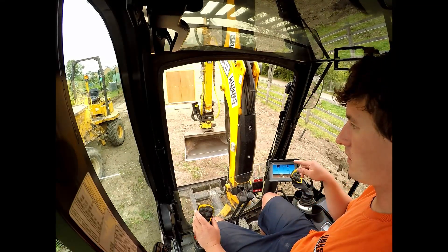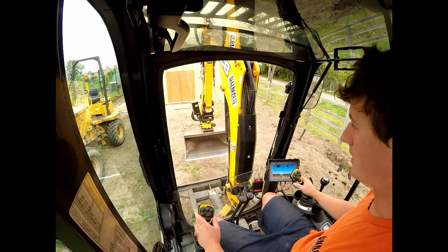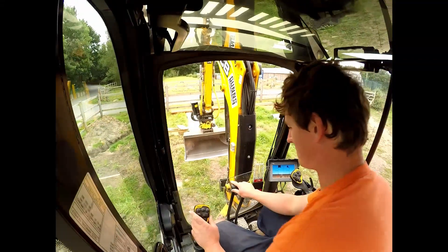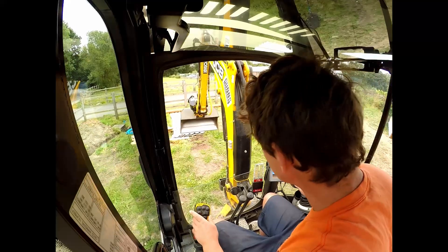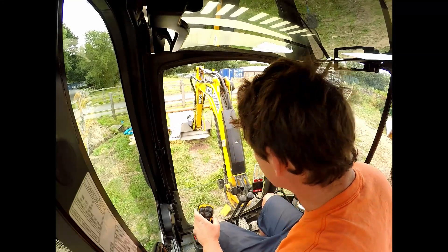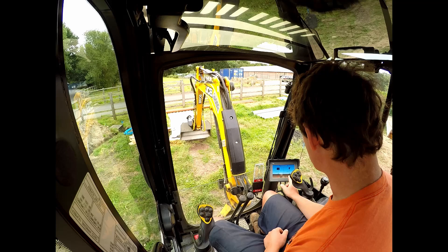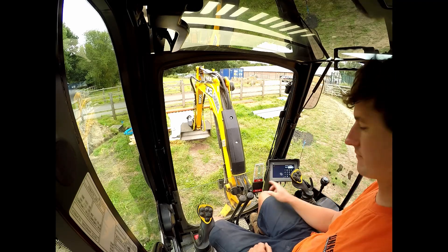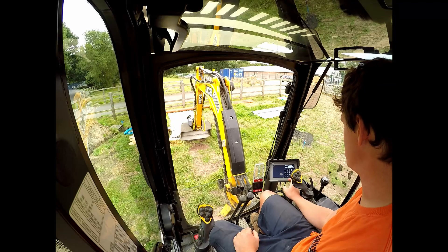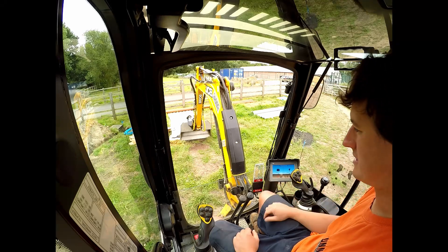Knowing I'm 200 mil higher, it'll work it all out. I can turn around to the high point because that's where I want to dig down from. I'm not removing the pin because I've got to put pads where those pins are — I'll leave them in as they're set out accurately. So I zero it — point two is what I'm going down, and it'll tell me I need to dig down 200 mil, or 20 centimeters, 0.2 of a meter.